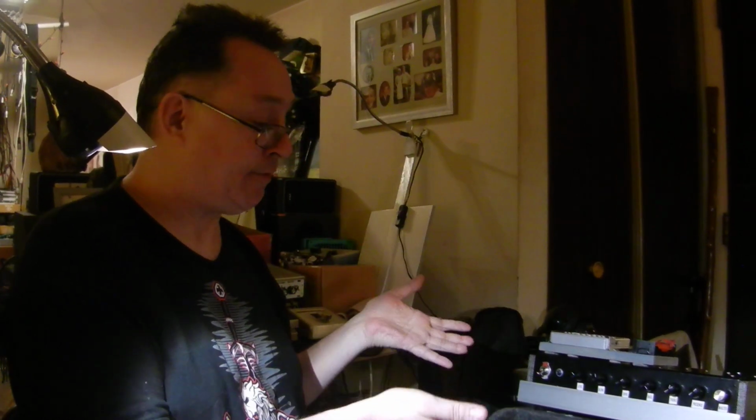As far as building amplifiers, I like to use the TPA 3116D2 mono board, which you can get for $3 from AliExpress, although you do pay about $3 of shipping. And those you're going to want to have a 24 volt power supply. So it's 6 18650 cells, or you can go with a dozen and double up on the capacity. And that's how we do it. So I hope you enjoyed this. Building a battery powered bass amp is a challenge, but it can be done.